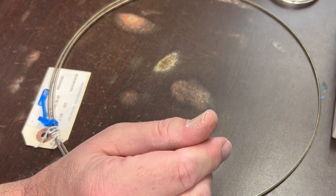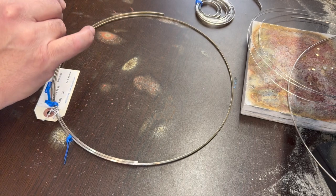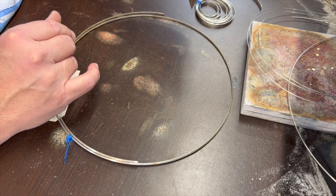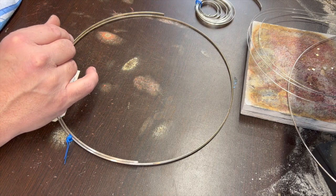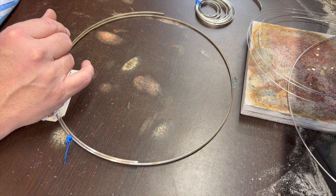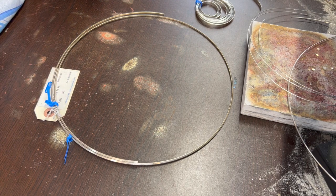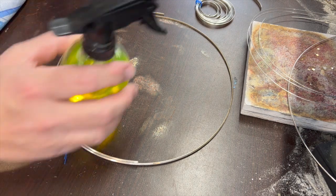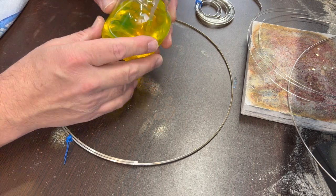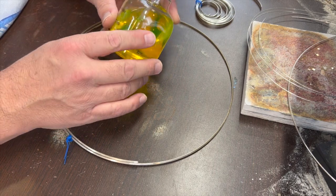The materials I'm going to need, as always, I'm using hard silver solder. Some people have been asking me why I use just that, and I'll be doing a video, the next video after this one, about that. The flux I use, I get asked this a lot, is Mighty Flux from Rio Grande. It's basically the same as Batterns self-pickling flux.